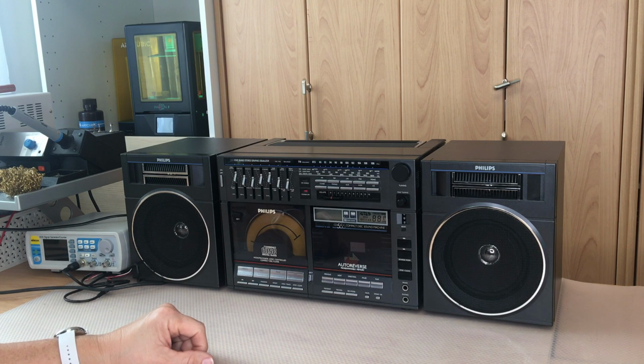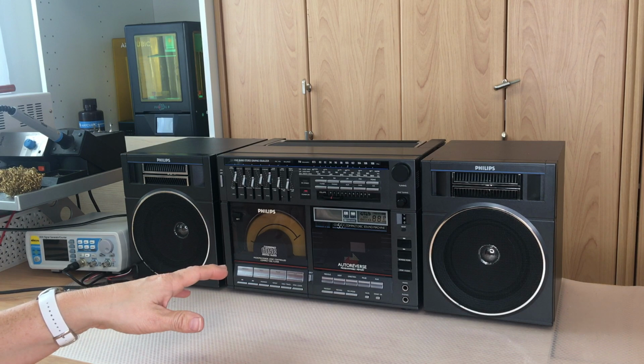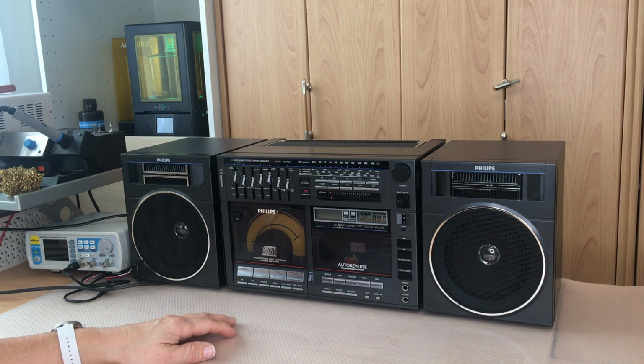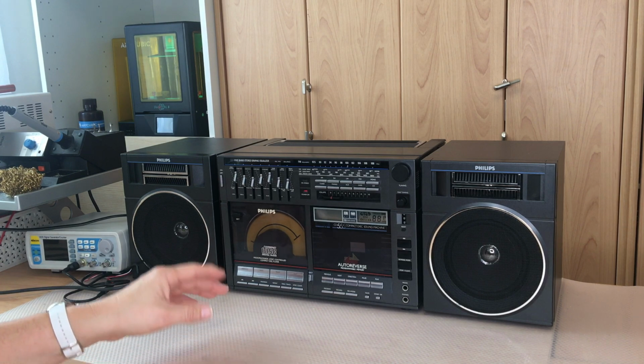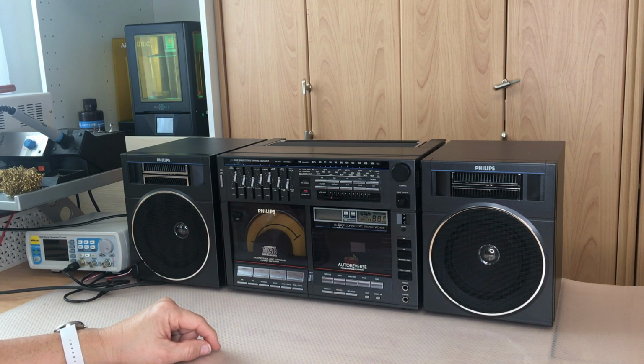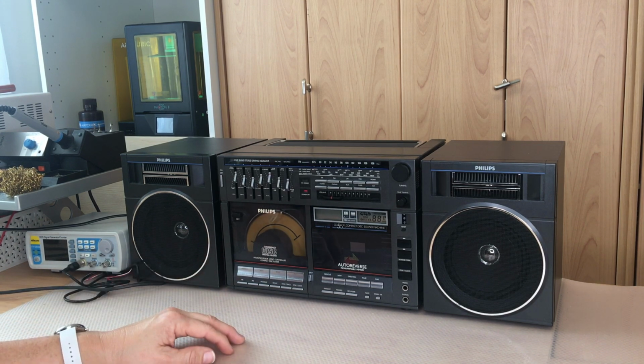And for the CD player, it seems that the decoder panel is not working properly. I'm going to exchange the capacitors first, because it could be a problem with the capacitors. As I said, the light blue Philips capacitors, they're all dried out. They're all out of range, and it's good to exchange them. I'm going to put the chips all on a socket, so that it's easier to exchange them and try to find something if it's wrong.